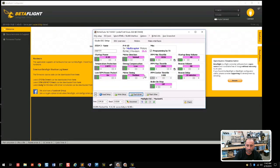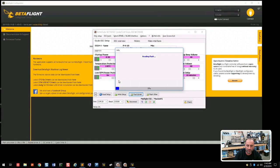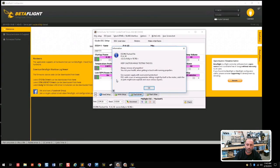Now look, a good rule of thumb here, guys, and in this case I can't do it, but I would tell you, make sure that you disconnect your VTX. It's going to heat up sitting here while you do this. If you want to save your VTX, or if it bothers you how hot it's getting, either unplug the wires or do something. If you can't, no problem, but just don't waste any time then.